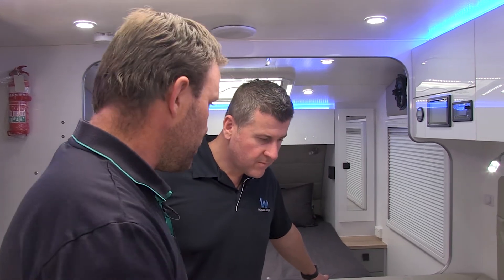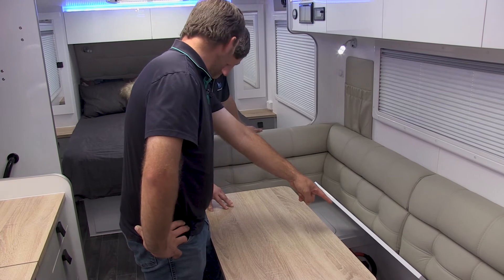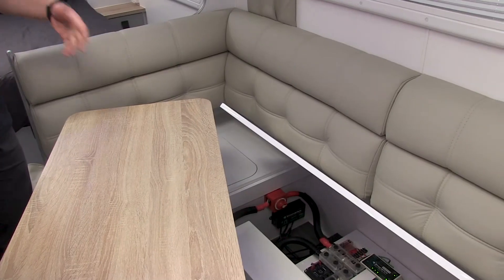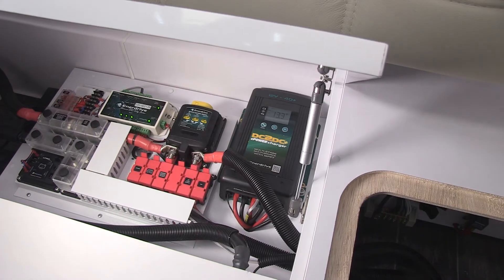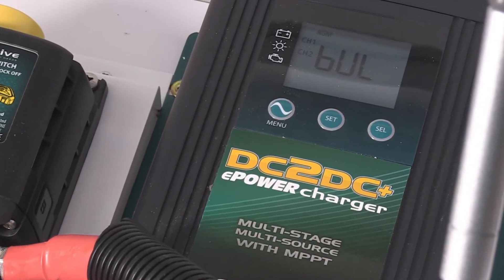But not everyone can safely control their battery chargers as well. And that's one of the key defining features of an Enerdrive Pro Series system — we can actually shut down our battery chargers when required. In a high voltage scenario, but even in the event of switching our loads off, we want to safely control our battery chargers first.